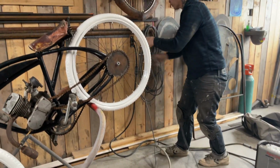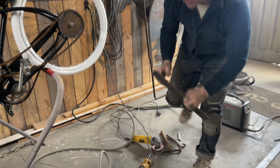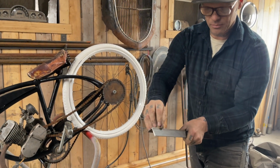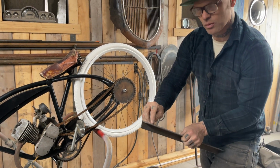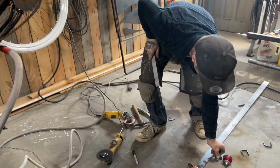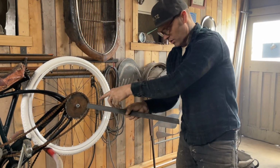I didn't really explain that well. What's going on is I'm going to use this angle iron. I'm just going to cut a little sliver off and use a little bit of the angle iron and put the flat up here. I'll weld that on there. Then I'm going to slot it with a hole. I'll slot a piece of metal with a hole that is welded to this. That way I can slot it, put it up and down. This piece will stay on the chassis forever.